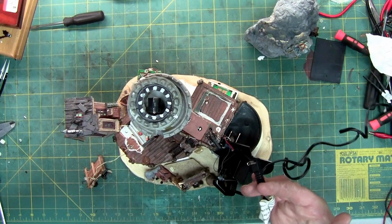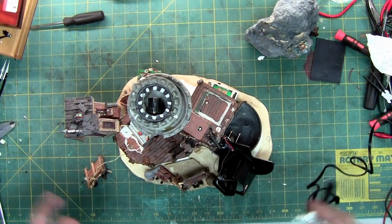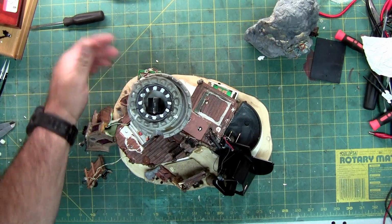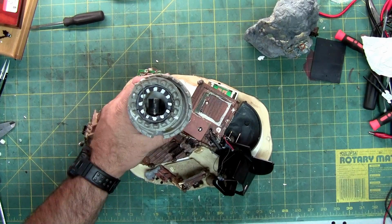This was the problem. Bad power supply. Got another power supply. Hey, and it works. So, yeah, that was great. Spent all this time taking it apart, voltage testing it, getting improper voltages, thinking that I had a bad power regulator chip on the boards, and it turns out that they're not bad. They're not getting enough juice to do their job.